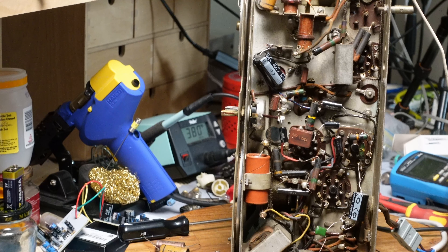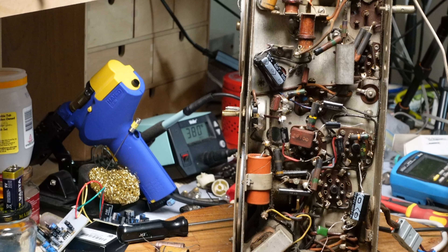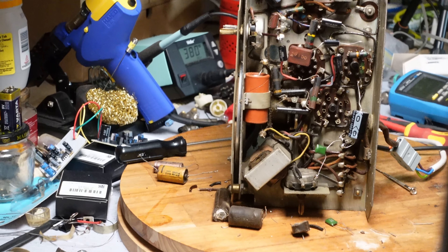It's working and it's sounding pretty good without an earth, so it's got that usual hum through this system - this power system we've got here. I'll have to check the voltages on the valves; I don't know what condition the valves are in. Some of them are looking pretty sad - there's an EBF35 and it's black, not red. The chassis is pretty filthy, so it's going to need a very big clean-up. It's also going to need a new power cord.